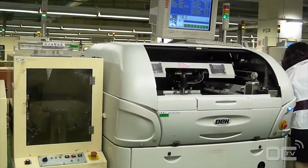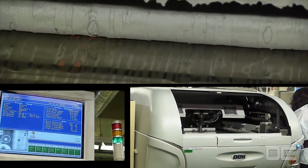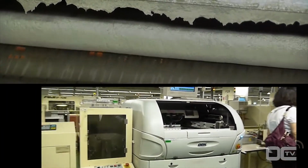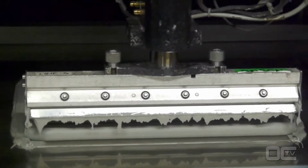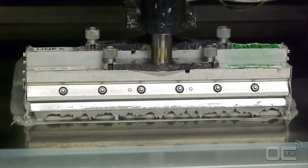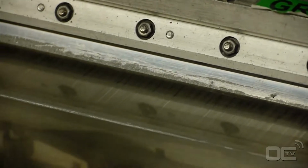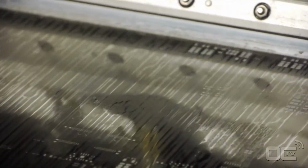Every part of the PCB that will be in electrical contact with a component gets a special soldering paste. The solder paste acts like a glue for all these chips before going into the reflow oven for definitive soldering. In that way, every small component can stay in the right position before being soldered. As you can see, the solder paste is applied to the PCB space only where you will have the components.